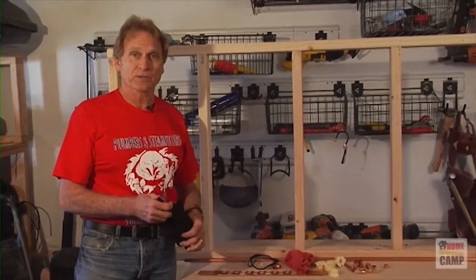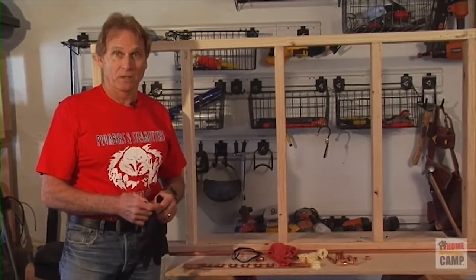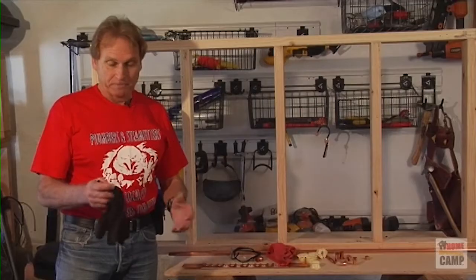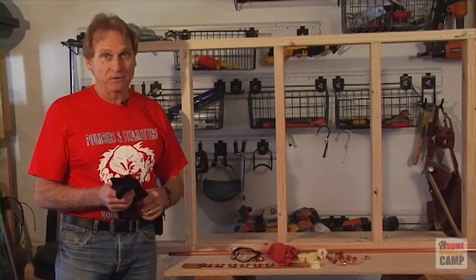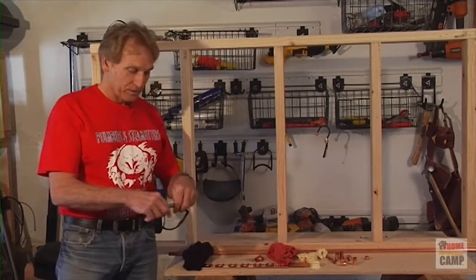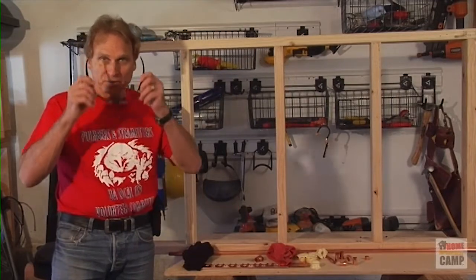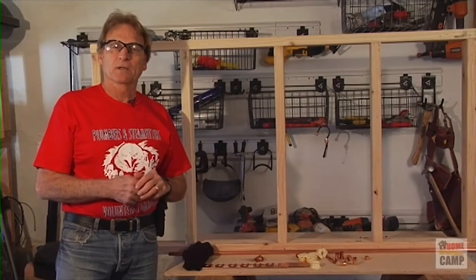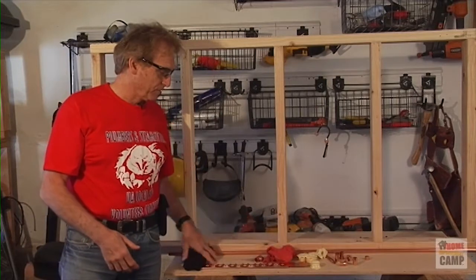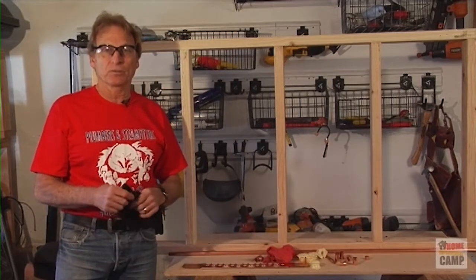The first step is safety. Remember, the temperatures of soldering copper pipe using map gas can reach up to 2400 degrees Fahrenheit. Wear cotton gloves — do not use plastic gloves because they will melt right to your hand. Always wear safety glasses in any type of construction. I always keep a rag because the flux gets very hot and if it touches your skin you will be burned.